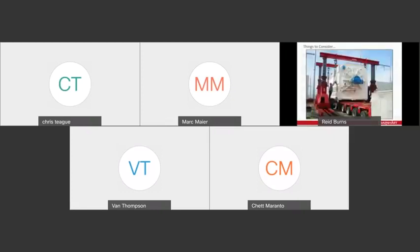And the last consideration point I want to make is how important it is to size the gantry arrangement, not just for the load you're lifting, but you've got to take into account what you plan to do with the load. So here's what I mean. So let's say we want to lift a generator that weighs 375 tons. Now, the generator in this picture wasn't nearly this heavy, but for the sake of argument, let's say we're lifting a generator that weighs 375 tons, and I need to lift that generator, I need to travel it in, and I need to lift it up and over a pedestal that requires 14 foot of stroke to get up and over it.